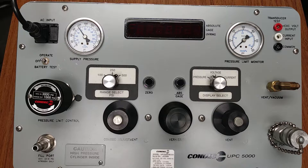Let's verify what model UPC 5000 we are presently using. By looking at the ID tag, we find the model area is marked UPC 5000 VCCA. This would be your ID tag that would be on the system. By using the model numbering guide located in the operation manual, we now know the unit's required input power is 120 volts AC and it has a 12-volt rechargeable internal battery.